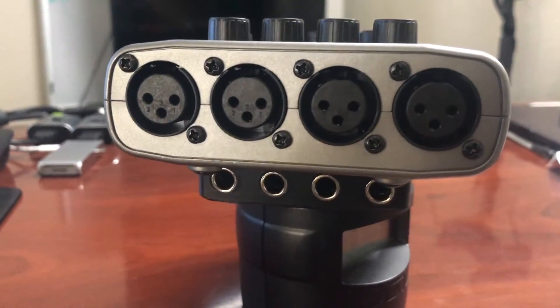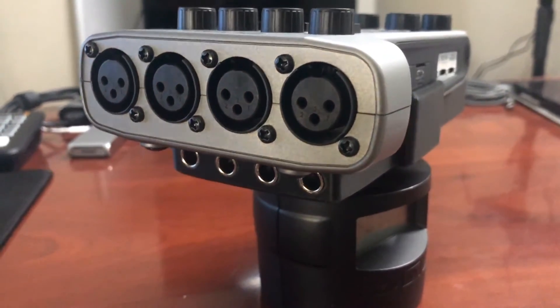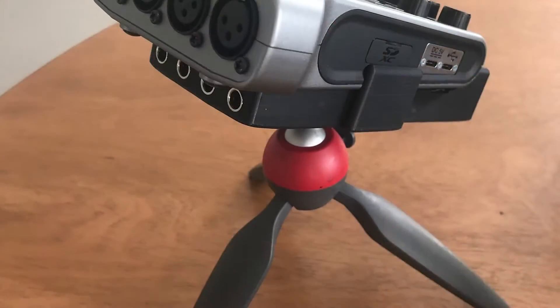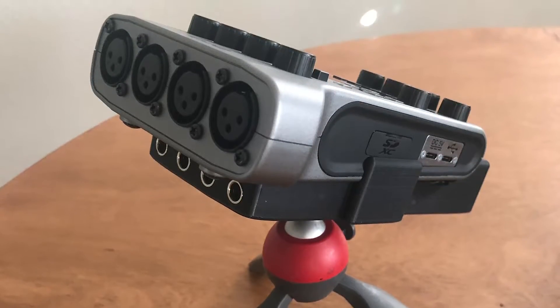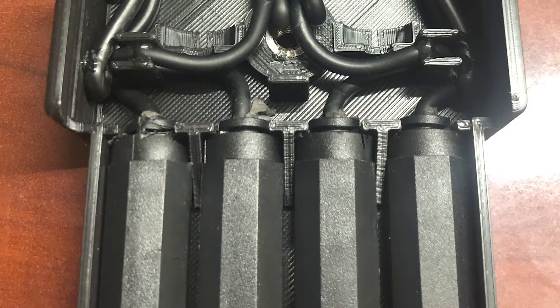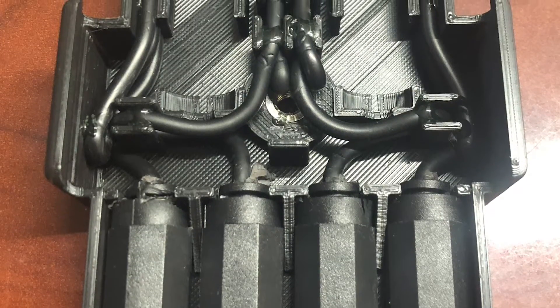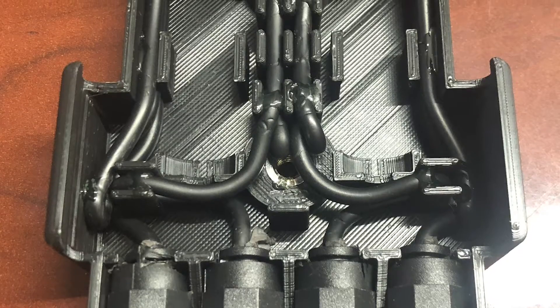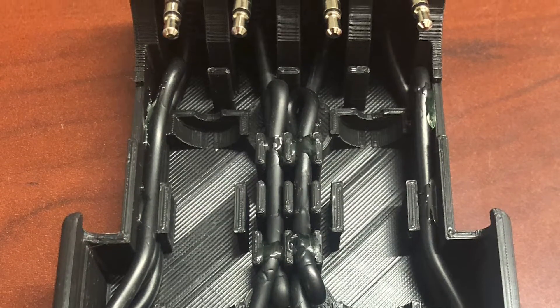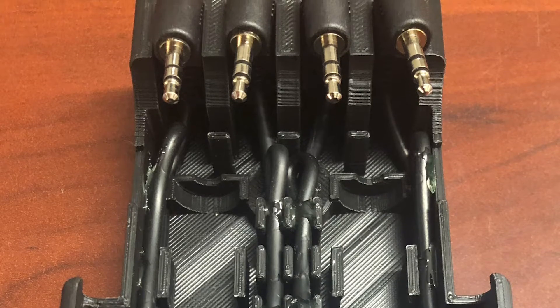It's a mod to the P4 that makes it over-the-top amazing. It takes the headphone jacks, turns them around, converts them to quarter-inch female, and also adds a tripod mount on the bottom. You'll notice in the guts of the unit it was a bit of a challenge, because I had to put all these cable stays in here — the only 90-degree headphone conversion jacks from 3.5 millimeter to quarter-inch that I could find were 10 inches in length, so I needed room to route the cables. I super glued the cable stays in to allow that extra wire length to be absorbed into the unit.